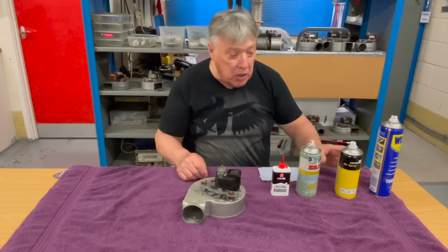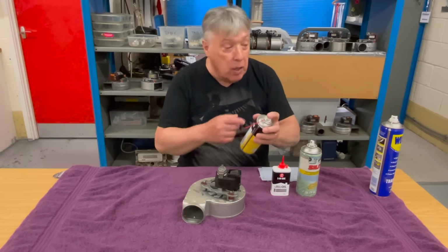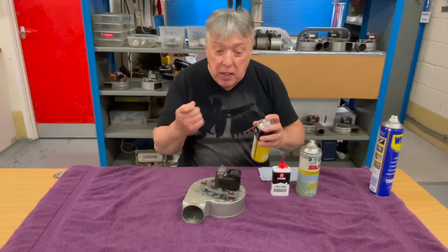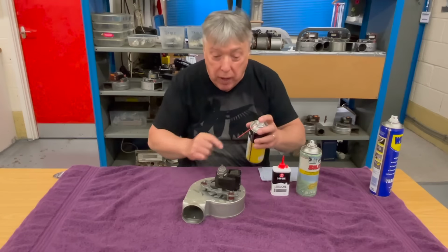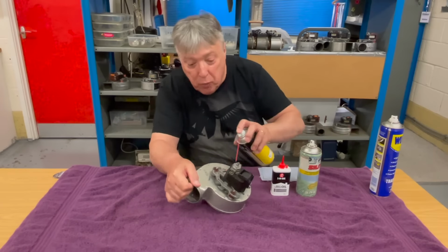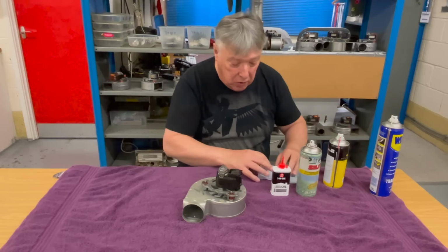The next thing we need to have is our favorite can of fresh air to blow that out because it's got into the bearings, but because it's a degreaser, it doesn't oil the spindle because it's not designed for that. So we have to get that fresh air and put it all around here and remove as much of that WD-40 as possible.